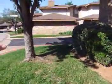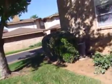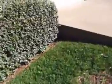You can see here we've got tree roots down here. There's a big tree here. Almost certainly those roots will extend under the foundation of the building. Not much you could do about it, but be aware that there could be roots growing under the foundation itself. Around here, we're coming up to the neighbour's drive. And there's a lot of build up of debris and mud up against the foundation here.